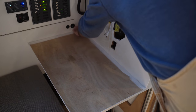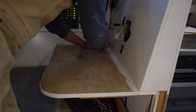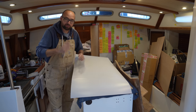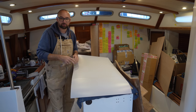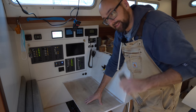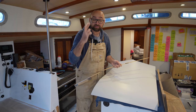To get this to lay flat, there is a little bit of paint I need to clean up along the edges. I want a nice flat surface so I don't get any voids in between the plywood and the laminate. With the surface sanded, it's time to move on to cutting this to the right shape, which is no doubt going to be the trickiest part of this project, because this stuff really likes to splinter or crack. The aft edge and the side of the table are no problem — I can let the laminate overhang and trim it once it's glued in place. The slightly more tricky part is this inside corner, and I only have one go at this, so fingers crossed.